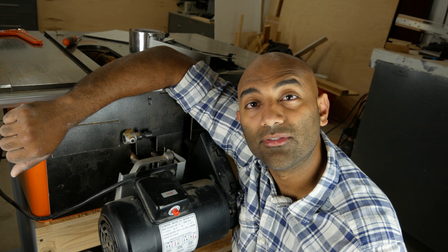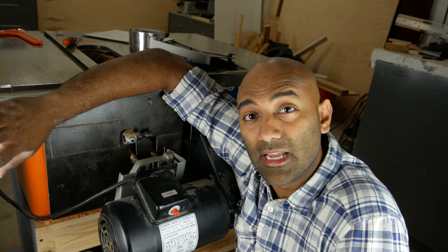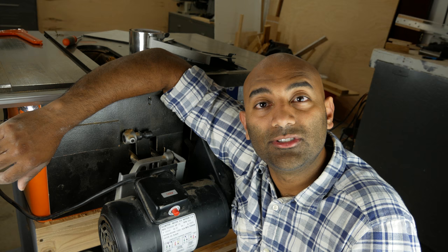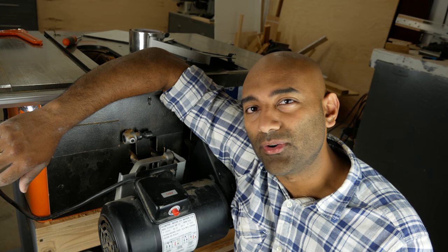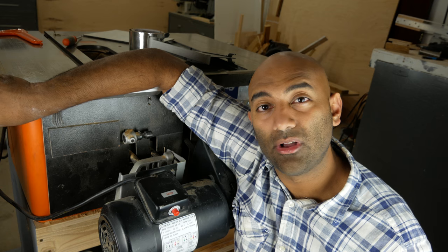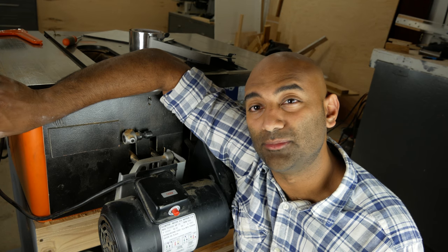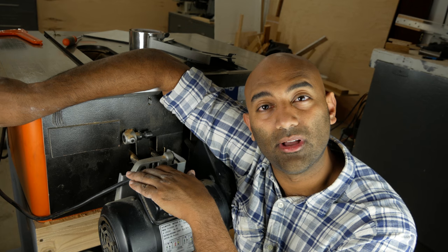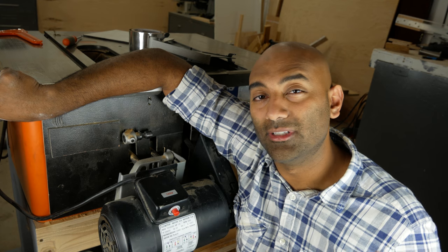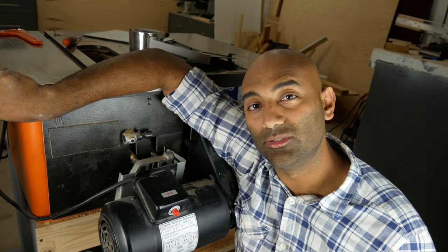The last thing I want to bring up about dust collection is to create less sawdust, and how you can do that is with a thin kerf table saw blade. I've been looking at a Forrest thin kerf table saw blade for some time — they're about a hundred dollars and they last a really long time. When it's time to resharpen, maybe after three to five years, you can send it back to Forrest and they'll sharpen it for about $25. If the average table saw blade is an eighth of an inch, the Forrest thin kerf blade might be 30 to 40 percent thinner — the result is you'll make less sawdust, cut less wood, and put less stress on the table saw. All win-win-wins. Think about getting a thin kerf blade especially if you have a smaller 110 or 120-volt table saw that doesn't have as much power as the big boys. There you have it — those are our top tips for dust collection for your table saw. If you liked it, give us a like, share the video, thumbs up, subscribe, and as always we'll catch you guys next time.